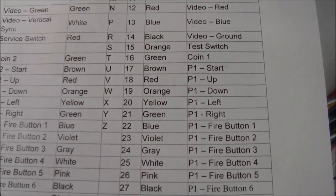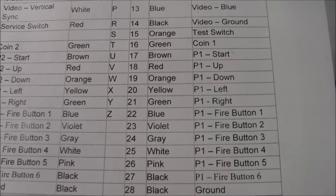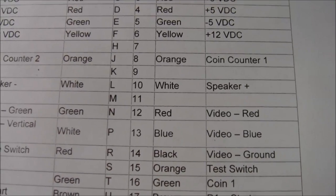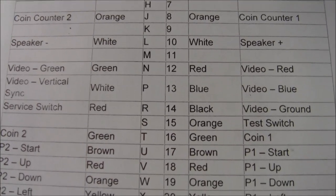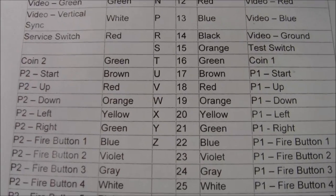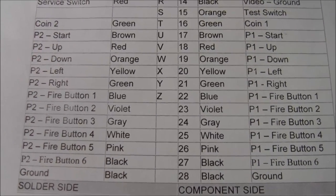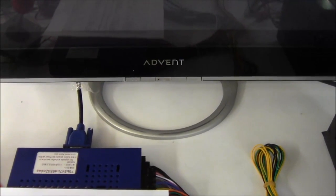It's just a case of putting the colors onto the buttons and onto the joystick. The two white ones go to your speaker — there they are. The next ones down you don't need — those are for arcade monitors. Test switch is red and orange. And you can see all the setup for both player one and player two for the joysticks and for the buttons. That's it — nothing to it.